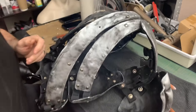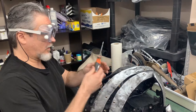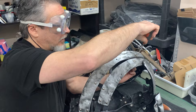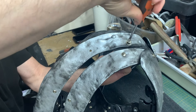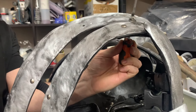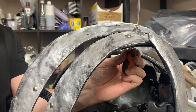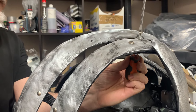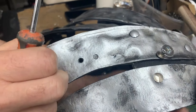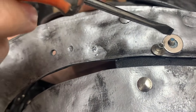I've made my slit and the glue now should be soft due to the heat that was produced by the cutting wheel. I've got about 30 seconds before it cools. I'm holding one screwdriver on the inside where the actual screw is, which allows the screwdriver to get in. And now I've introduced the other screwdriver into the slit that I made, and you can see that it's unscrewing just fine. And there it is. You can see the blue residue on the screw — that's what's left behind from the Loctite.